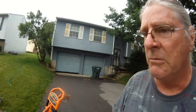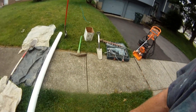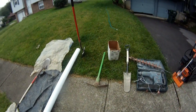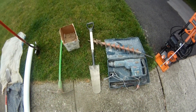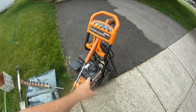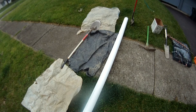Hey, good morning. Chris here with Atlantic Drain. This morning we're in Pickerington, Ohio, and we're going to be doing a sidewalk tunneling and pipe installation to the street. Choices for tunneling a sidewalk are a tunneling shovel, the Bosch hammer drill with an auger, or a pressure washer with high pressure coming out of the nozzle.